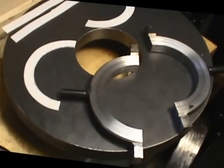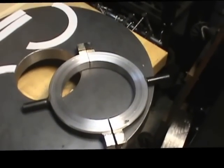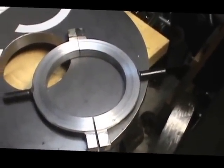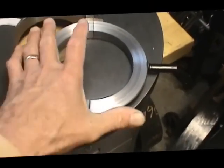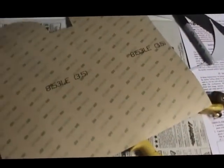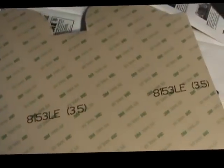So then I had to go back to the lathe, put these two parts together, bolt them up, put them back in the lathe, and machine out the JB Weld that had hardened, and then you have to machine it back off. So my wife then did some more investigating, and she found a similar Teflon material, but it has a factory applied two-phase adhesive tape. It's a 3M product, 3M 300, and it's supposed to bond to virtually any surface.